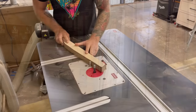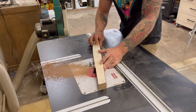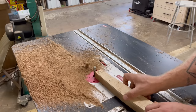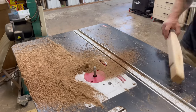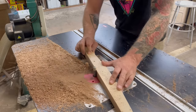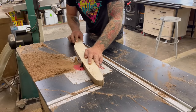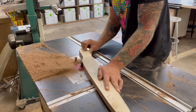To cut out each one of my individual pieces, I'm using this pattern routing bit from Bits and Bits — it's a spiral upcut/downcut bottom-mount bearing bit. I don't know exactly what you call it, but it's available on their website. Bottom line, this thing is awesome for template routing because you can go any direction you want on the grain, do end grain no problem, and I never get any kickback. I'll include a link to this bit in the video description, and I even have a coupon code so you can get it at a discount. The trick is you just want to cut your shapes pretty close to the size of your template so you're not removing a lot of material at once. This thing cuts like butter, making very quick work of my individual shapes, and it was still only the first day — we are cooking on this chair.